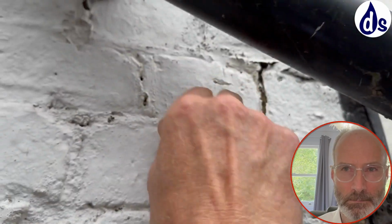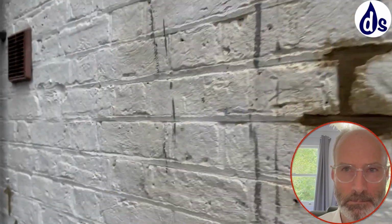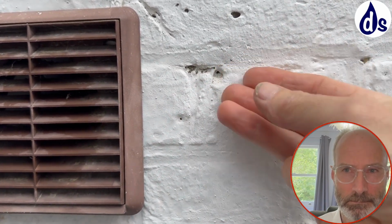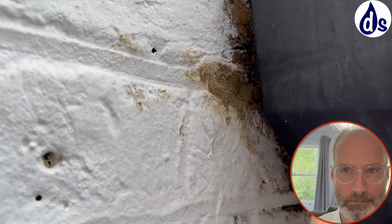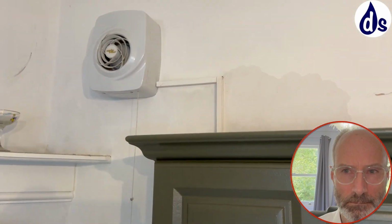So here we've got examples of defects where they haven't painted over them, presumably because it was hard behind here, but they're still defects. And these ones have been painted over, but probably with a Weathershield type semi-permeable paint that allows the moisture in, but it's hiding the defects, so the water's getting trapped and can't evaporate out, so it goes into the brick, causes heat loss, and a small amount is obviously coming all the way through. So the difference between the permeability of the brick and the paint, and then equally behind here it isn't painted. They may be hygroscopic because this is an old chimney breast and it would have come all the way over.